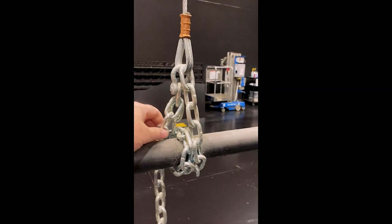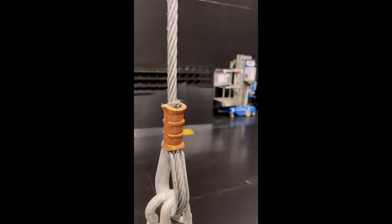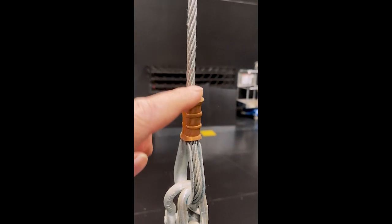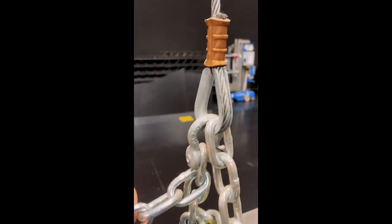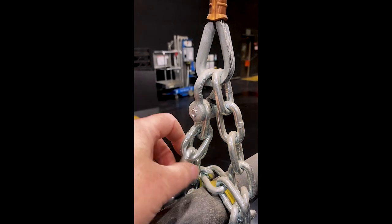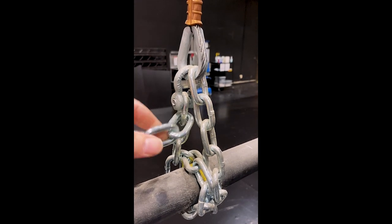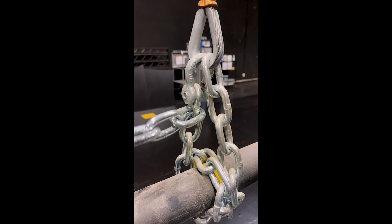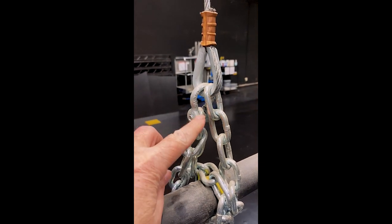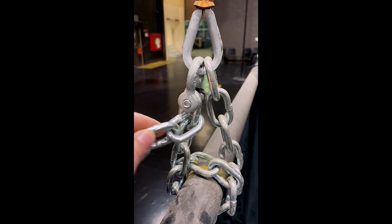This is a close-up of the way that I prefer a Nikopress swage. One's got a little more tail sticking out than I like — you can poke your fingers on that if you're handling it. One end of the chain is locked into the thimble, does two wraps around the pipe, comes back up, and then the shackle is adjustable to level the batten. Just remember that these extra links between the shackle and the piece of chain have to be loose and free-flowing — they can't be pinched.